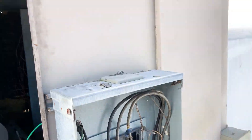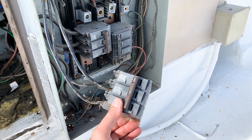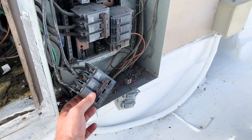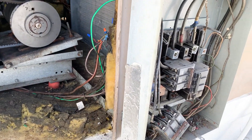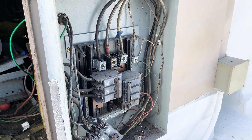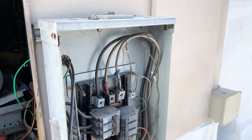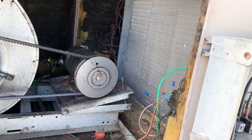We're going to replace the motor. We're going to put a control box here with a motor starter, downsize this breaker, which was a 60 amp, which was tripped — so that must have been quite the burnout. And tighten up any other issues we can with this unit within reason. I mean, it's still a turd, but it'll be a polished turd.